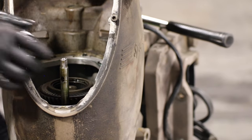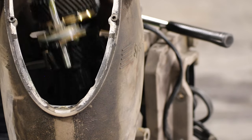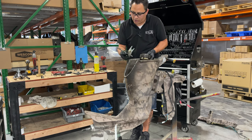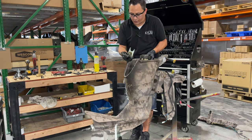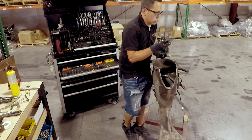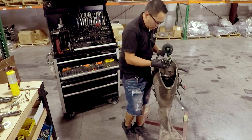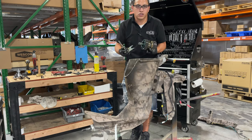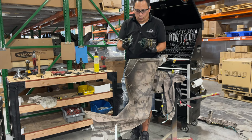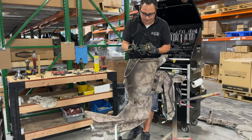And this is the important part. Well, everything is important, but this one is your clutch. This is the shift fork. Obviously, you have the shift shaft. These are all Mercury gears. They call them the yoke and cam. It's this part. Actually, I'm gonna try to take some pictures and put them out there for you guys to recognize and know the name, the part numbers, and whatnot of every single part that goes into this transmission.